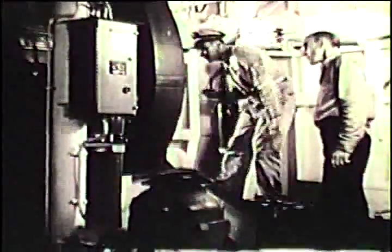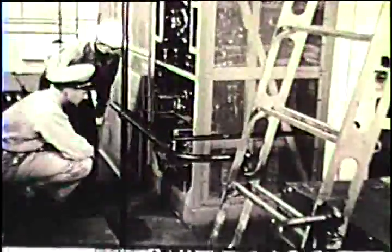If motor number 3 is too badly damaged for use, it must be cut out of the propulsion loop so that number 4 motor can be used to turn the shaft. Be absolutely sure that the control board is dead before touching anything inside the grating. A damaged motor is disconnected by unbolting and shifting the motor disconnect link. These are short, heavy strips of copper running vertically from the bus bars in the control board to the motor